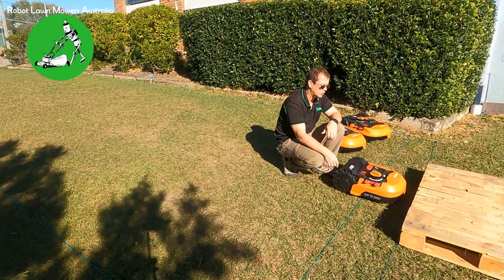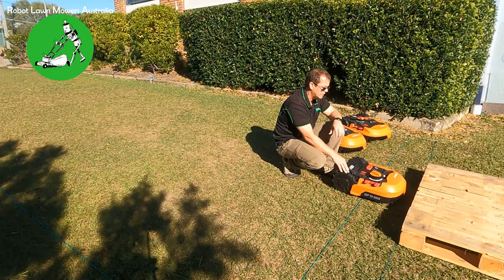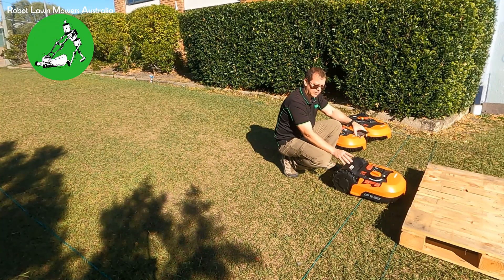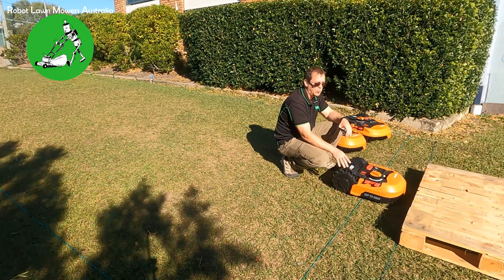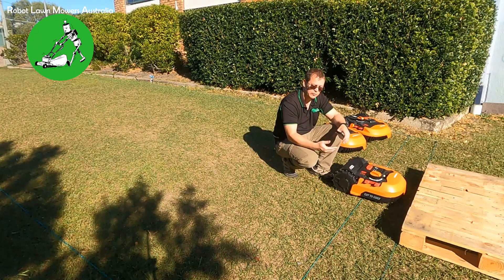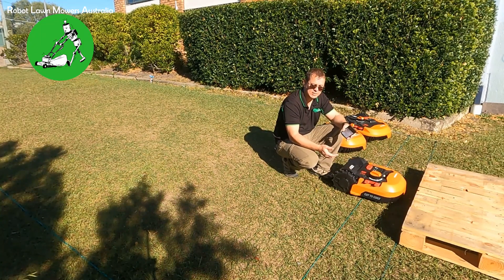Other times it'll manage to get its way out. The fact that it's crossing the first boundary wire and hitting the fence — that's the issue we're trying to establish and eradicate. What we've found is that moisture has a significant effect on how much the boundary wire actually inducts into the fence line. The wetter the area, the more induction we get, so the worse the problem gets.